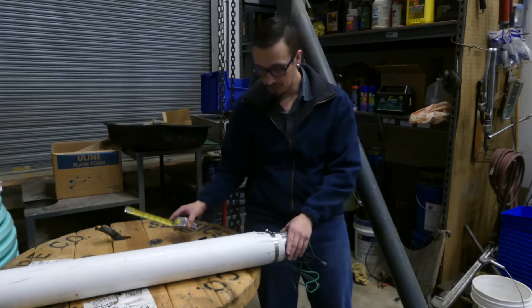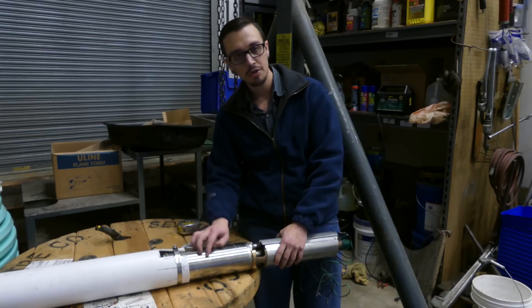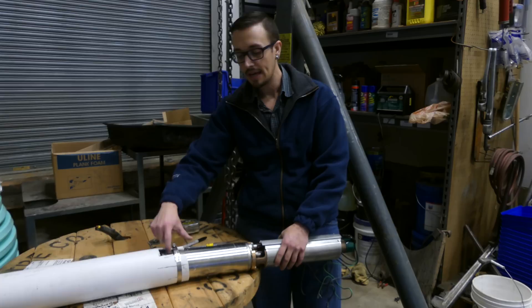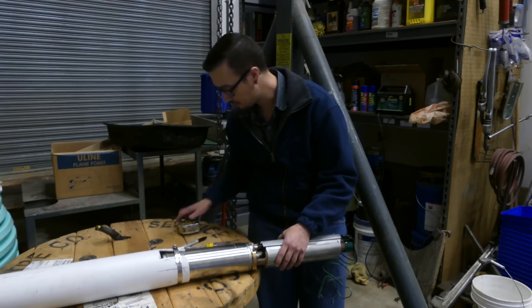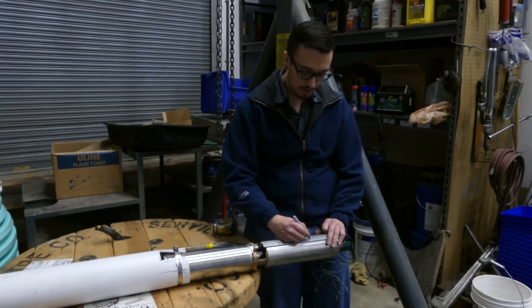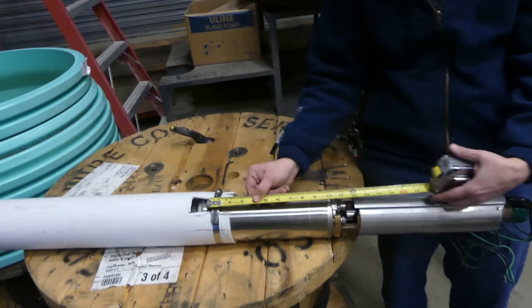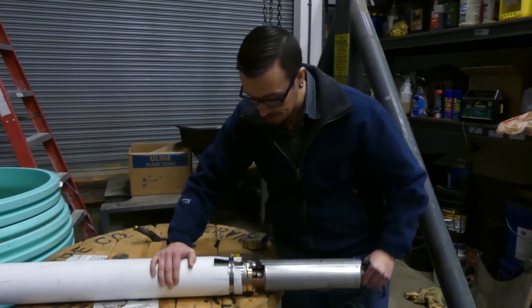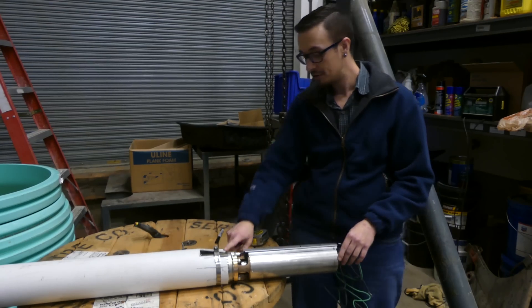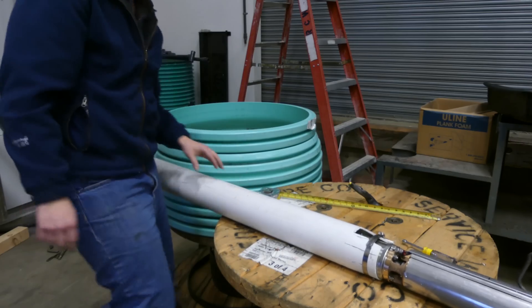One thing to remember: with these motors, they're kind of soft and squishy in the middle but reinforced and rigid at the top and bottom. So we're aiming toward the bottom where it's more reinforced. It's going to be really easy to dent right in the middle because that's just the windings of the motor. I want the top of the sleeve to be about here, then I'll measure to the spot on the motor where I want the screws — about that bottom inch. That works out to about 19 and a half inches from my line. I'll pre-drill these before the motor is in, because I don't want to poke any holes in it.